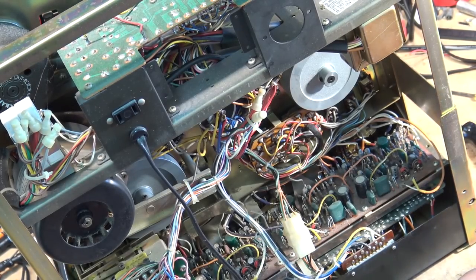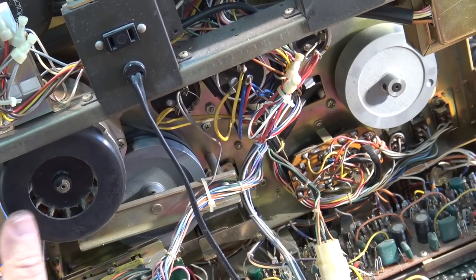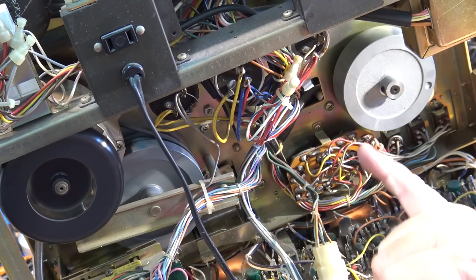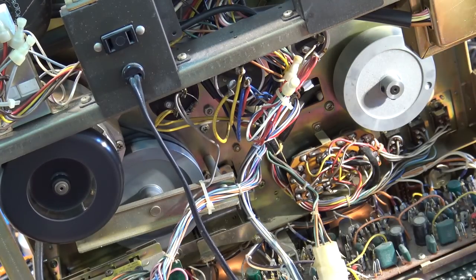It's a 2 microfarad, 250 volt, and that is it there. Lower the camera down so you guys can see it. If the motor loses torque, that's the run capacitor. Lots of torque. So there's no problem there, but that's the one that's going to fail, if any. If the motor is running slow, that's the cap to change. It's an oil-filled 250 volt AC capacitor, 2 microfarads.